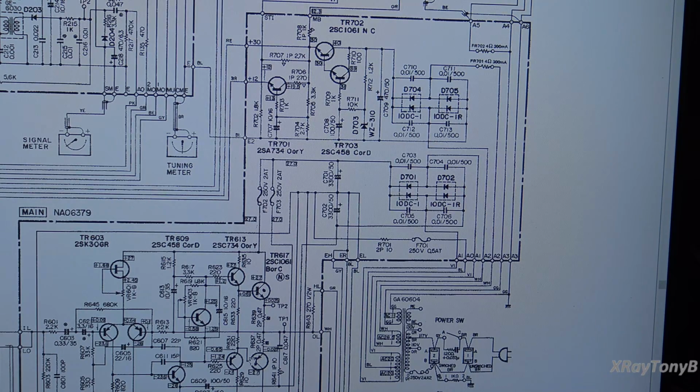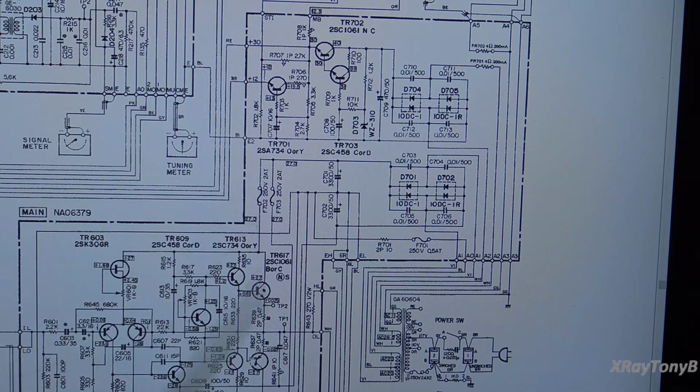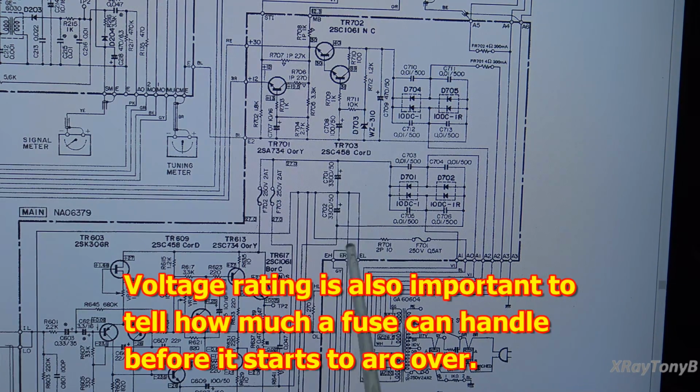And if you notice, automotive fuses, the glass ones, the same 7 millimeter or the 1/4 inch fuses that you're used to seeing, if you look at the side of them, they're rated at 32 volts at that amperage, not 250, and there is a difference. They will blow at different current and wattage ratings. So I always thought that fuses were very interesting, how they're rated by voltage and current. But in some ways, they should rate them by the wattage. So anyway, that's enough about fuses for now.